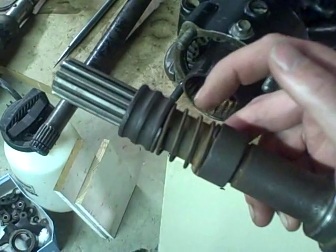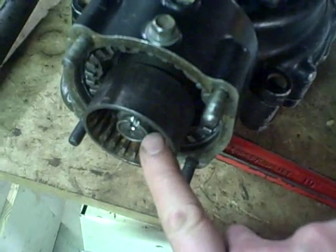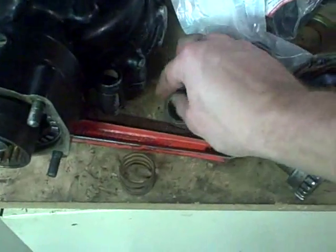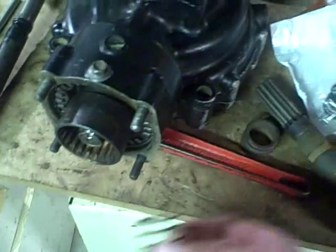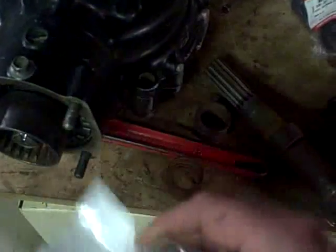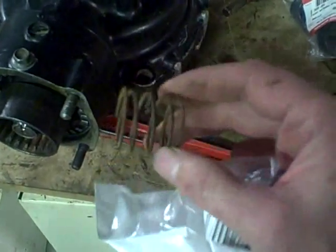The parts breakdown almost appears like there should be a spring between this gear area and in here. So I ordered the spring that was on the parts list, because I wasn't sure whether this spring on the shaft was actually the spring that goes here. I ordered the spring, a new one came in, and it's identical to this one. So that tells me this was indeed the correct spring.